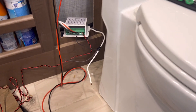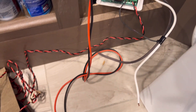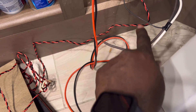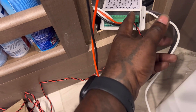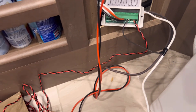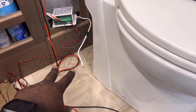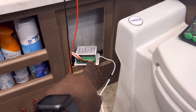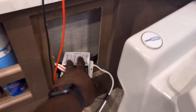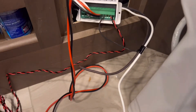Now let's see what we have. This is the feed wire - I measured it and was only getting about two to two and a half volts. My next step would normally be to go find out where the source is because I'm getting low voltage. But from experience I know that this device can cause that voltage drop if there's an internal short, and I don't have to look any further. So I want to test the voltage while it's disconnected from that box.